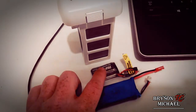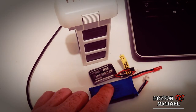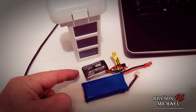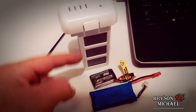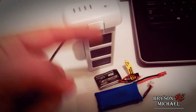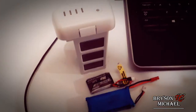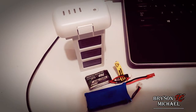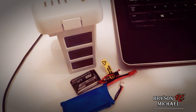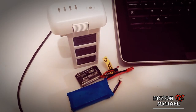So to recap: time your charge, number your batteries and work through them in rotation, drain your battery all the way down and then recharge it — don't partially drain and partially recharge repeatedly. Make sure you're continuously using all of the charge and then recharging it. Thanks for watching, guys — hopefully this has been some help. Please hit that subscribe button and talk to you guys later, have a good one!